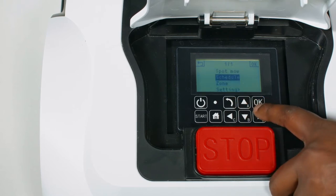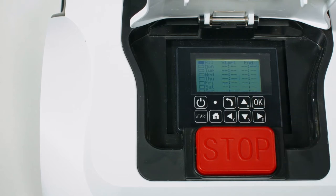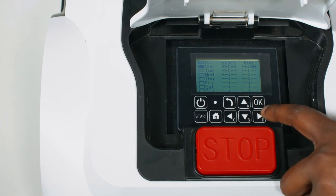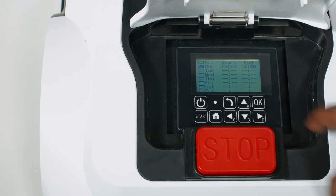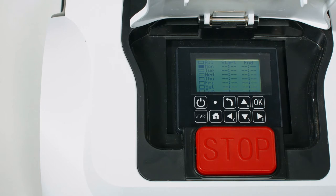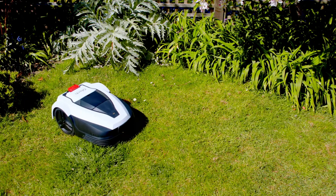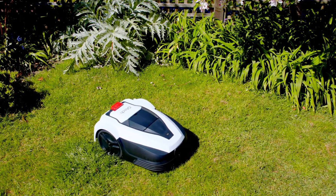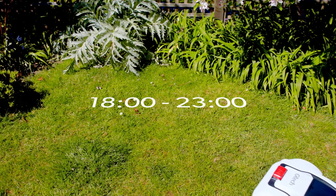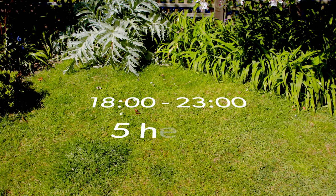From the first sub-menu, select schedule and press ok to select the desired day. Use the arrow buttons to set the start and end time, pressing ok to confirm, then repeat to complete the weekly plan. To remove the schedule, deselect the day by unticking the selection box. If the work time hours don't match with the schedule, the robot mower will adhere to the work time. So to set the robot mower to be active from 6pm to 11pm, set the schedule to reflect this and set the work time to 5 hours.